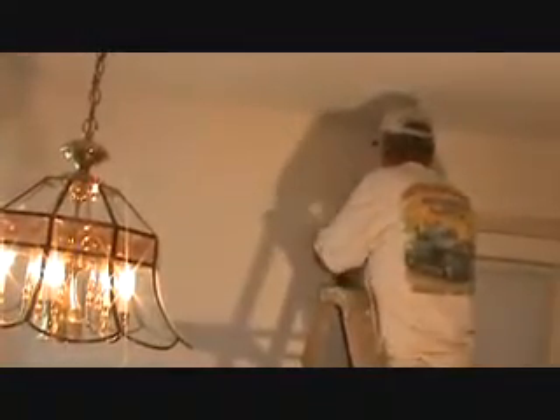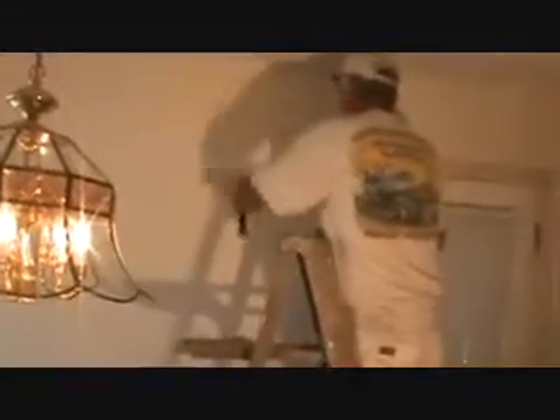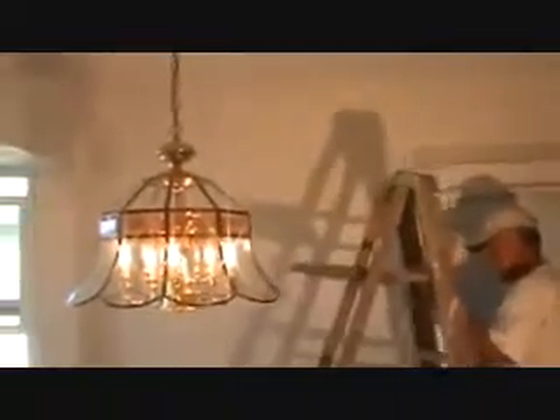Keep the color on the ceiling. The crown molding will be Swiss coffee also, which will offset the color of the walls. We're putting the first coat of finished paint on the wall. Jim just installed a PVA primer, the sealer, and the universal primer on the walls. They spray textured the walls before that, and now he's putting a full coat of the finished paint.